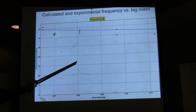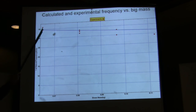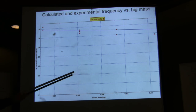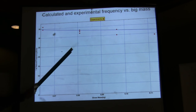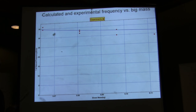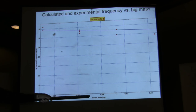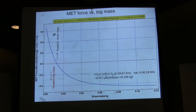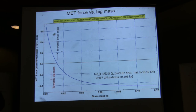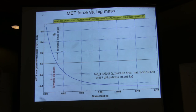So I want to show you the natural frequency versus experiments. These are the experiments, and this is the calculation. Take into account that this is an exact solution. It's not finite element analysis like that. That's really good calculation. Those red dots are our results, and the blue line is his calculation. So it's actually a simple calculation with just two unequal masses, a spring and a dashpot can get you most of the way to where you want to be.